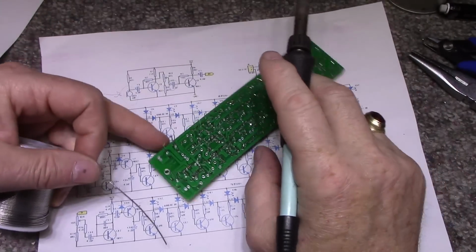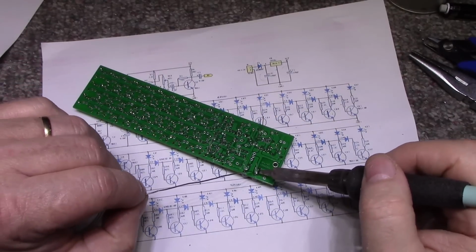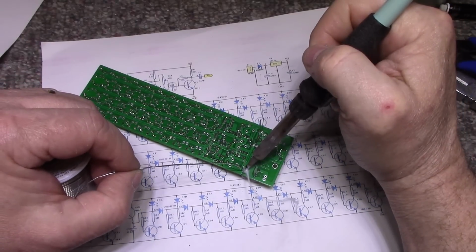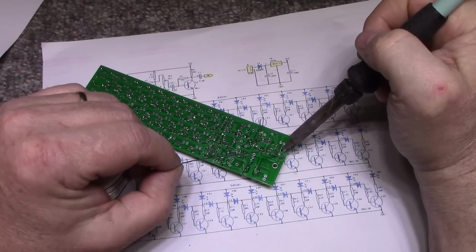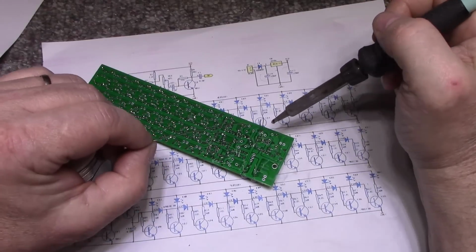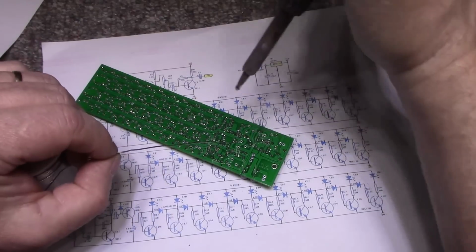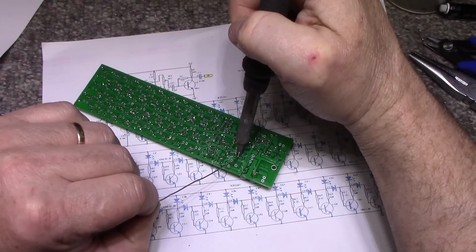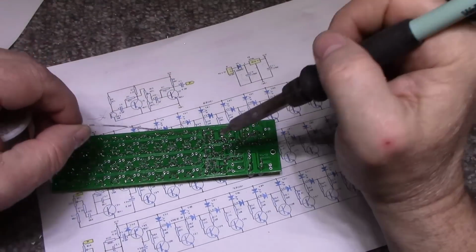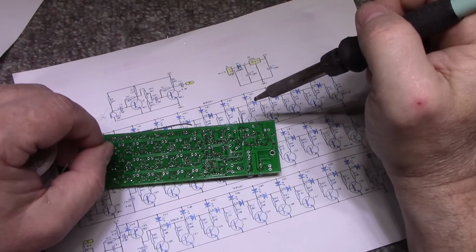But then they brought in printed circuit boards, and it sped up things a lot. All you do is you get your part stuffer, and he stuffs the parts on the board, and the next guy comes along and solders them, I think. Or maybe the one person does it all, I don't know. And then they developed automation, which is your pick and place machines and wave soldering. So they solder the entire board in one pass. It was all brought in to help speed up manufacturing and increase profits.